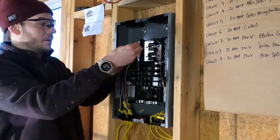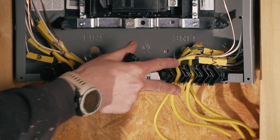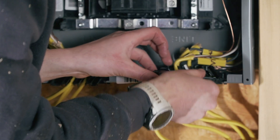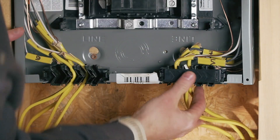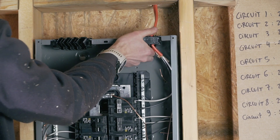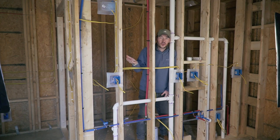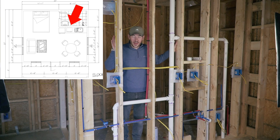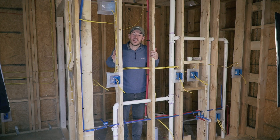I'll take care of all the grounds when I get that additional ground bar. I was finishing up circuits seven, eight, and nine with all double pole breakers. The orange line is the only 25 amp, 10-gauge wire for my water heater. To keep everything in place once you're done, they give you little blank fillers to snap into any unused spots. As promised, I got another ground bar and was able to finally connect all the ground wires on the right side. In the next video, we will talk about installing the plumbing system in the cabin — this is the kitchen/bathroom wall and I have run all the sewer lines as well as the water line. Definitely click on that link to check out how I managed to figure that out, and spoiler alert, it wasn't easy.